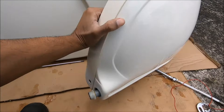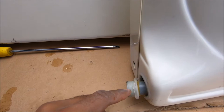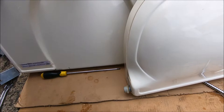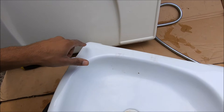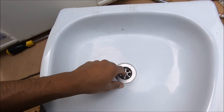You can see it's just been hot glued from factory to this pipe here. What we'll have to do is clean this pipe up here and re-glue it with some better glue. Once that's done, let it dry and then wiggle it all the way back into position, then put the screw back in place. I'll go ahead and clean this up now.